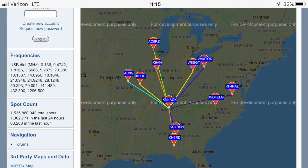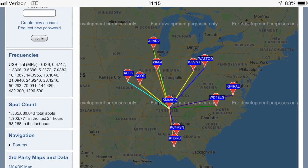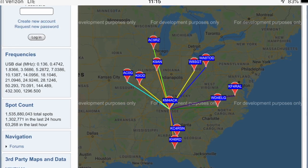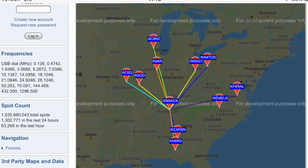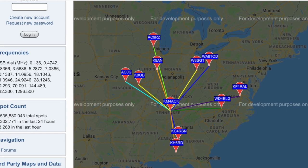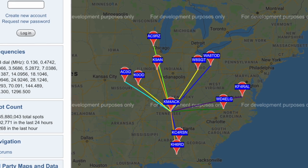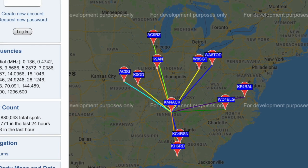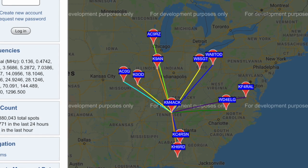Taking a look at the map — I'm having to do this from my mobile phone since it's the only internet connection I've got right now. You can see that we're spread out pretty good, omni-directional. Looks like we're getting connections all the way up into Chicago, and we're being heard down into South Alabama — so kind of regional. Now I want to swap over to the NVIS antenna and see if we can shorten that up even more. It does look like 40 is starting to shorten up more than I thought, but let's see if we can get some stations inside of Tennessee to hear us.